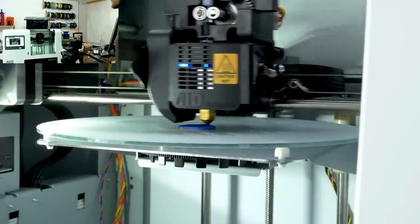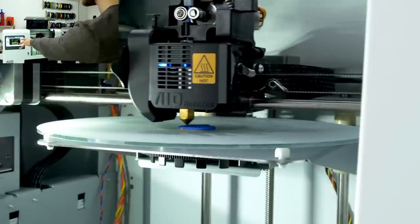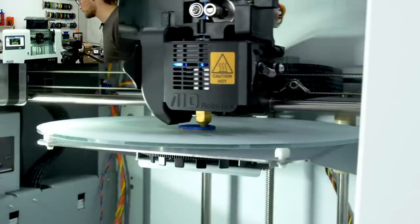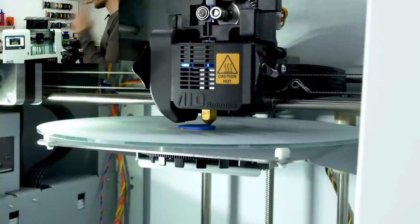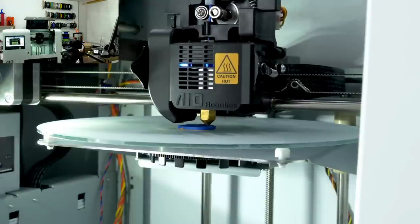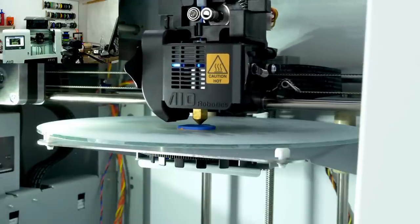Yeah, and I mean, print speed is pretty fast. Do we have some sort of reading right there? Nah. We're not getting a millimeter per second reading on the screen, but it's decently fast, and accelerations and stuff are fairly high as well. Of course, I'm gonna test this one for resonances, because that's always a problem with these higher acceleration and higher speed machines. And it is a direct drive, or non-Bowden extruder.